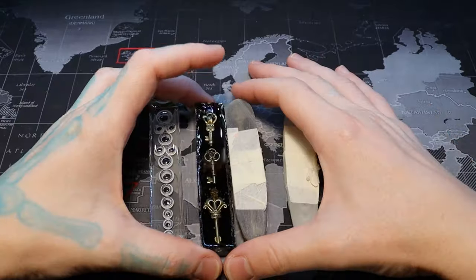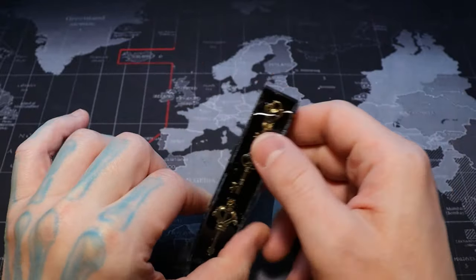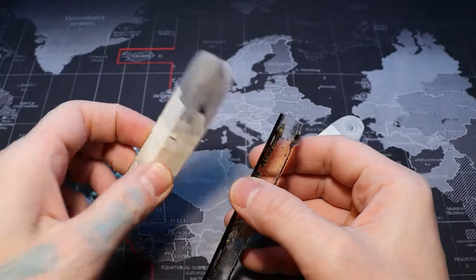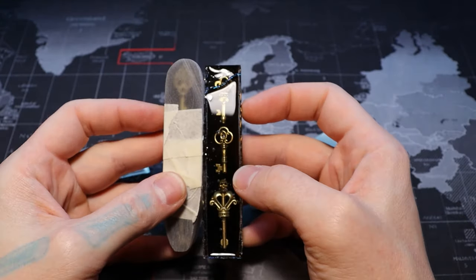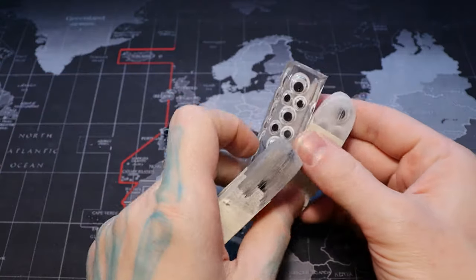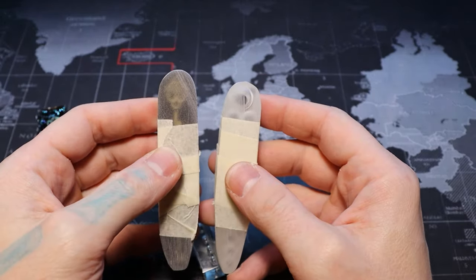Okay, as you can see, as I took these, I flattened down all the sides right here on the tops to get it completely flat, and then I shaped it around the sides. But before I shaped the sides, I found another scale that I thought would fit well, and I put them together and taped them together like this before shaping the sides. I also just did a general shape to leave a lot of room for after I glue the pick, to shape it up at the very end. So the next part is I'm gonna take these two right here that are taped up and ready. I'm gonna polish up the tops around those and get those ready for glue.